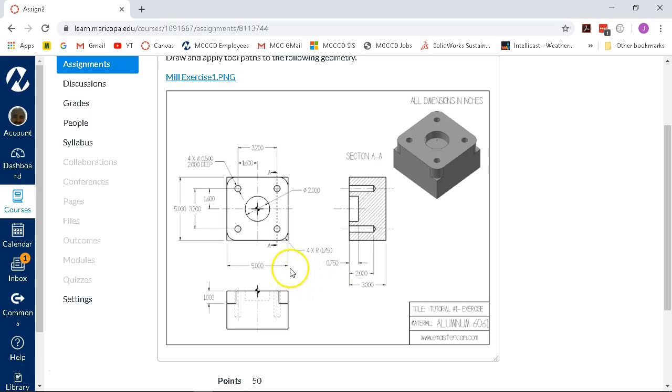So, a couple other choices just looking at this part is we're 5 inches by 5 inches. That's a pretty good sized part. Right? So when I'm thinking about this piece, is this going to be close enough? If we buy a piece of material that is 5 by 3 in bar stock and we cut as many out of it as we can get, and the 5-inch width is probably what, 15, maybe at least 10 thousandths, maybe 20 thousandths oversize on the raw stock.